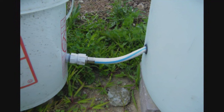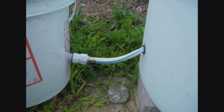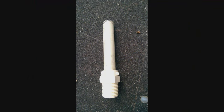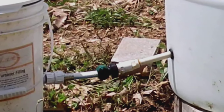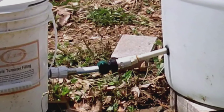This year the end that goes to the reservoir barrel just didn't want to stay sealed. So we replaced the grommet and took some half-inch CPVC pipe and put a half-inch national pipe thread fitting on the end of it. Then we attached an adapter to go from half-inch national pipe thread to hose thread, pushed that pipe through the grommet into the barrel, and made a hose to connect the new fitting to the float valve bucket. That took care of the problem — the leak is stopped.